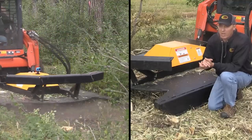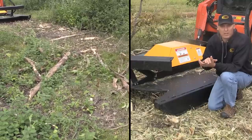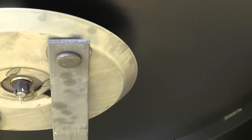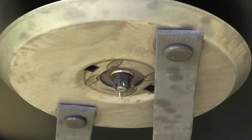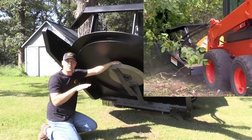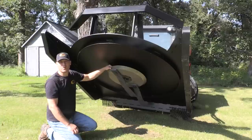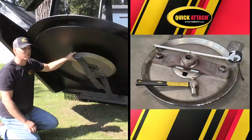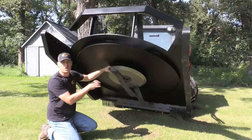This area we've done here — we're not going to work too hard at really mulching it down to a fine mulch because they're probably going to come back and burn it before they till it up. The stump jumper itself is made up of two main pieces. The dish pan shape part here is quarter inch plate steel spin-formed into a dish pan shape. What this allows is that the leading edge then has a ski toe effect — if you hit an obstruction, it'll help deflect the deck and stump jumper over the obstruction, which helps prevent damage and spike loads to the system. On the backside of the stump jumper, there's a one inch by four inch bar that runs the full width, and the blade is actually bolted to this. So you have a really strong, stiff structure to support these blades.